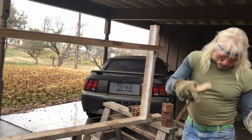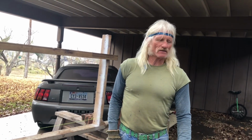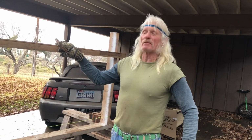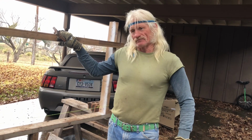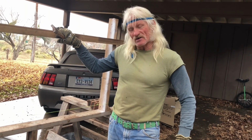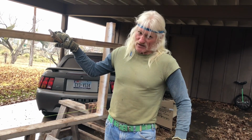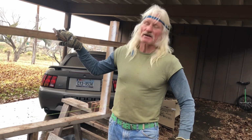Now that we have brick here, we're going to make the mortar. The reason we have everything ready before we make the mortar is because mortar has a schedule. It stays on that schedule. Once you make it, it's going to stay on its schedule. It won't wait on you to get ready. It's going to do its job, which will get nice and set up and hard and everything. So we do that last, when we're ready to actually lay the brick.